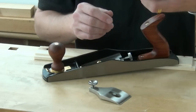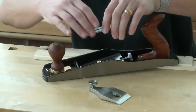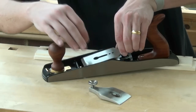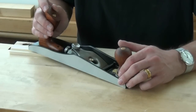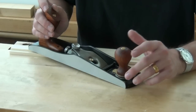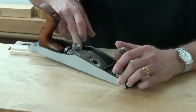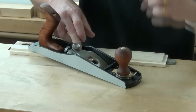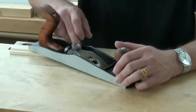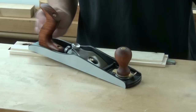But this is an out-of-the-box review, so I'm not going to do anything to the blade — no honing, just straight back in. The low-angle jack is quite well praised for being able to tackle difficult timbers, but I personally feel that's probably more to do with the fact that you can quickly change out the blade for one with a much steeper bevel, giving a much higher effective planing angle. Probably straight out of the box, it's not going to be any better than a standard 45-degree bench plane. But we'll give it a go and see how we get on.